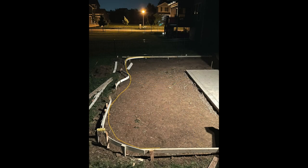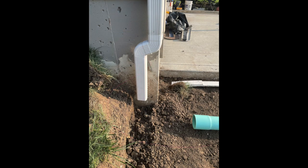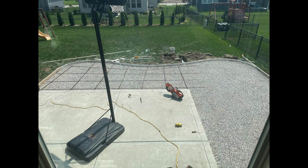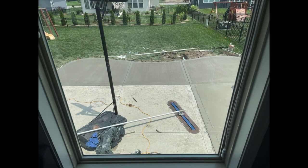And this should have really been a massive red flag. The other issue we had was what to do with this buried downspout. We couldn't really run it horizontally due to the underground sprinkler pipes, so we had to run them all the way under the patio into the middle of the backyard. Therefore, I had to go to the hardware store again and pick up at least 30 feet of 4-inch PVC pipes and PVC cement.